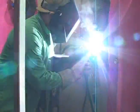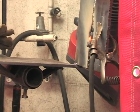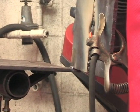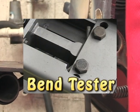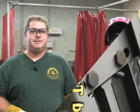This weld will take two to three rods to complete each pass. After he completes the weld, he'll have to chip off the slag and brush it. This is Megan Sellers. She's completed her AWS Structural Weld Code test and she's got her plate cleaned. We have coupons cut from that plate that we're going to test with our bend tester to make sure that it meets qualification standards.